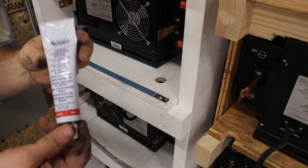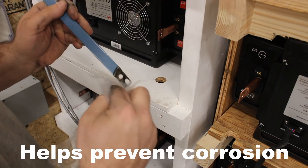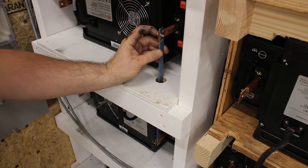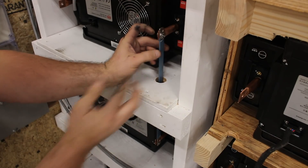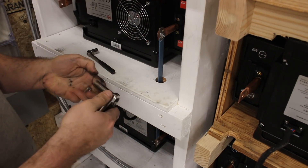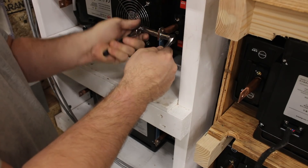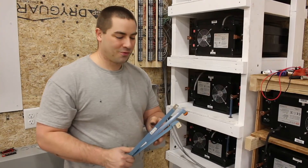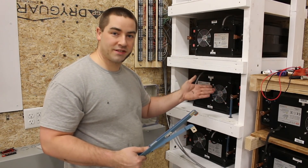The holes line up. This is some conductive grease — the idea is to use very, very little. These are 7/16ths bolts, and I did go ahead and dip these tools. We have 53 volts across there. I'm glad I saved these bus bars from the smart car build — they're coming in handy here. That's the process, it's just rinse and repeat. I have 3 more to go.